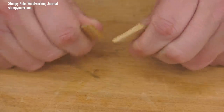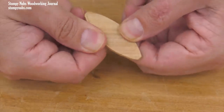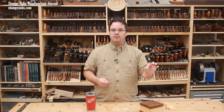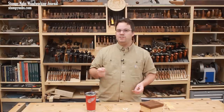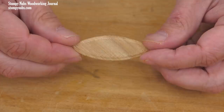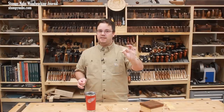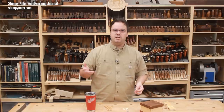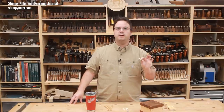That's not that easy. I can break a biscuit along its grain fairly easily, but there is no way I could break it across the grain with my fingers alone, even if I had more to hang on to, because the fibers themselves are much stronger than the lignin that binds them together. It'll break, but it takes a lot of leverage. And that's the weakness in any joint — leverage. When enough leverage is introduced, pretty much any joint is going to fail. A biscuit is only an eighth of an inch thick, so it takes a lot less leverage to break a biscuit than it would to break a dowel, a pocket screw, or various forms of mechanical joinery such as dovetails and finger joints. So biscuits are best used in situations where little leverage will be exerted upon them.